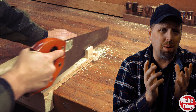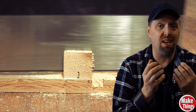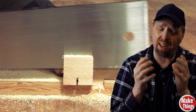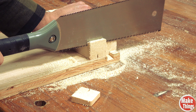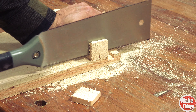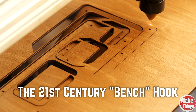Simplicity is the woodworker's best companion, as it makes troubleshooting problems easier. This design couldn't be much simpler and it works, but there is a slight flaw. Western saws like the back saw use frontward force to cut, which works really well with these bench hooks as you're forcing the wood against the back edge. But if you've gotten used to the more delicate and precise nature of Japanese-style pull saws, they're a bit cumbersome — I'm really having a hard time holding this against the back plate.